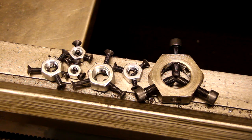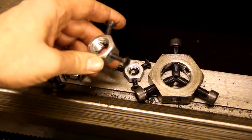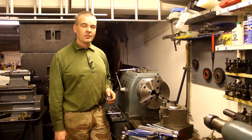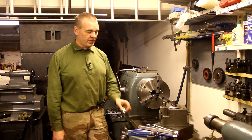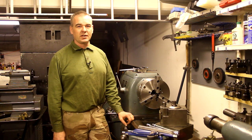To be able to conveniently turn the soft jaws under load, I've made these different size spiders that are, of course, just nuts with three drilled and tapped holes with long screws in them. I found a good discussion thread about soft jaws on a forum on the web, and it discusses the use of these spiders and some other things, and I'll post a link to that discussion in the description of the video.